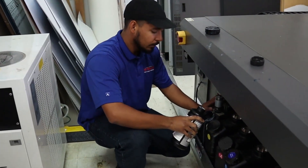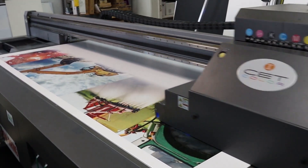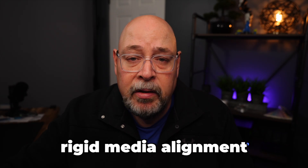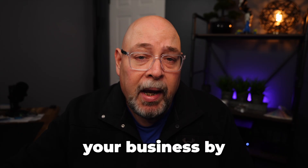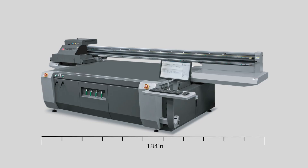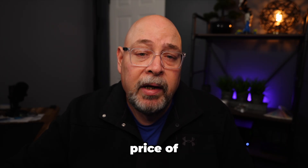The CET's fast-drying, environmentally friendly UV ink is free of VOCs. The ink comes in one-liter bottles of CMYK, white, and varnish, delivered through Ricoh Gen 6 printheads capable of 1440 dpi. Additional features include pin registration for accurate double-sided printing, simultaneous printing of white, color, and varnish, and field upgradability to add rows or heads for increased speed. The Q6500 is compatible with Onyx RIP software, measures 184 by 99 by 55 inches, weighs 2,536 pounds, requires a 220-volt single-phase outlet, includes a one-year warranty, and is priced at $89,000.